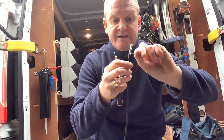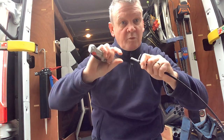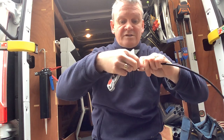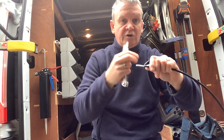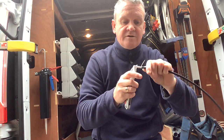The reason we do this is because when you twist the F connector onto the cable, if we don't twist the braid like that, sometimes it can just strip it back and you'll end up with loads of small pieces of braid just falling out of the connector.